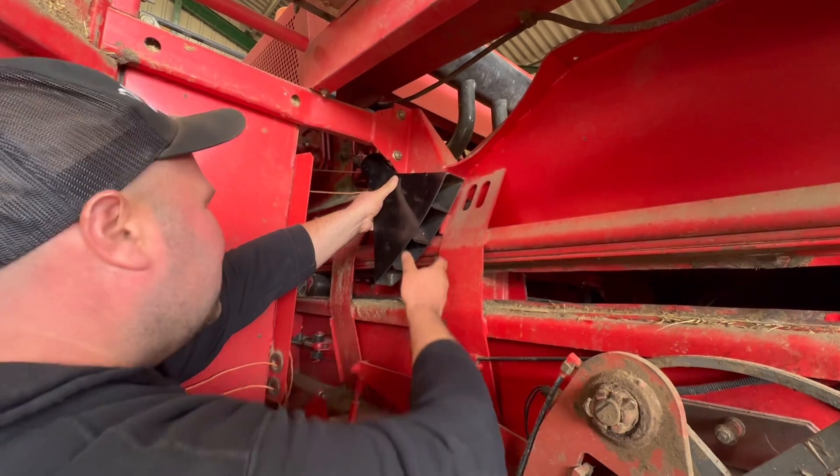I've also been working on a fire retardant tank to put next to the main tank on top. The way it works is very simple - if you've got a fire on the machine, you press a solenoid in the cab which opens the fire retardant tank into the lines for the jets, then hit the blow-off valves and it completely covers the whole machine with fire retardant. We're combining two systems into one - it won't just clean the machine, it'll extinguish a fire as well.